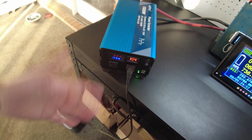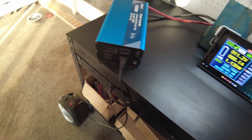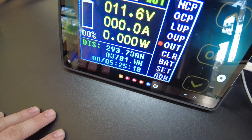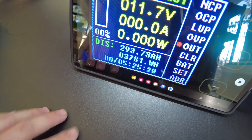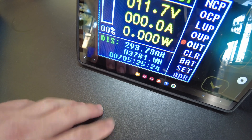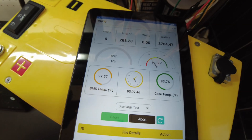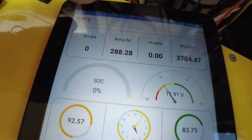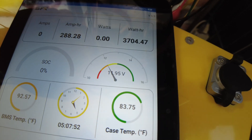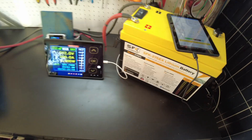So there's my inverter complaining. I always stop my capacity test at that point. Our final capacity is 293.73 amp hours, 3,781 watt hours. On the SunFun Kits app, it shows 288.28 amp hours and 3,704.47 watt hours. Pretty good result.